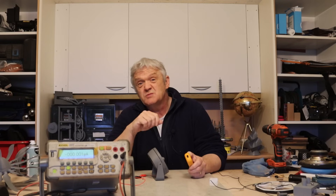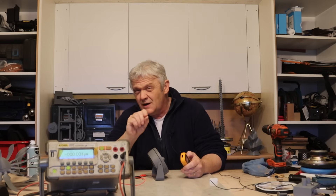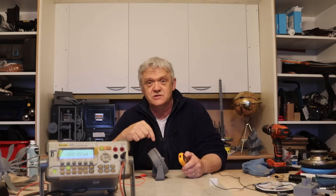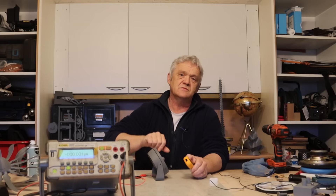I added the tubercles randomly — I just put four to each side, really no idea why — and we got that result, which I thought was pretty cool. Right when I connected it, we actually had a slightly higher amp draw, which makes me think there's a higher starting torque but a lower running current because of the tubercles. That could be why this doesn't actually work very well as a wind turbine — I tested it as a wind turbine and the results weren't impressive. But under a constant load as a fan, it seems to work brilliantly. It's the toroid shape incidentally that doesn't work well as a wind turbine; the tubercles work brilliantly on a wind turbine.